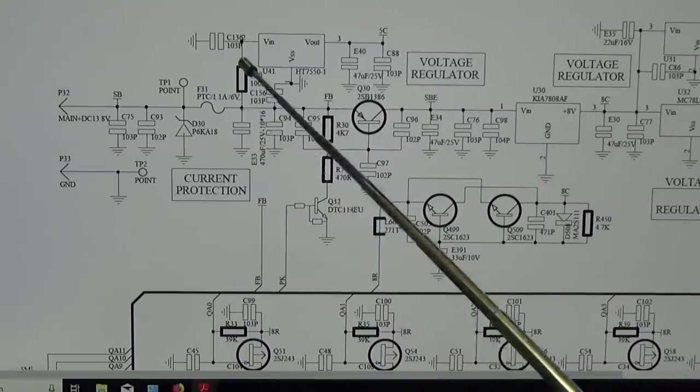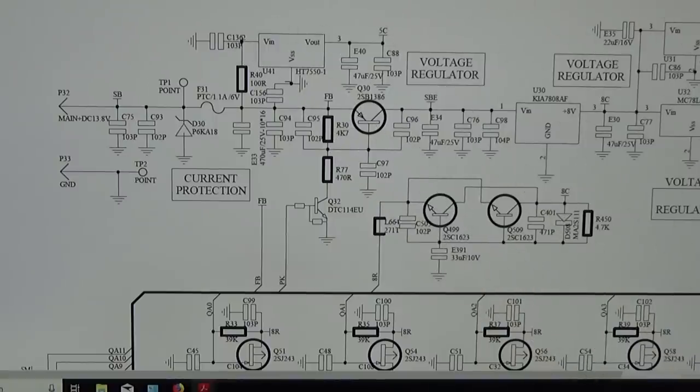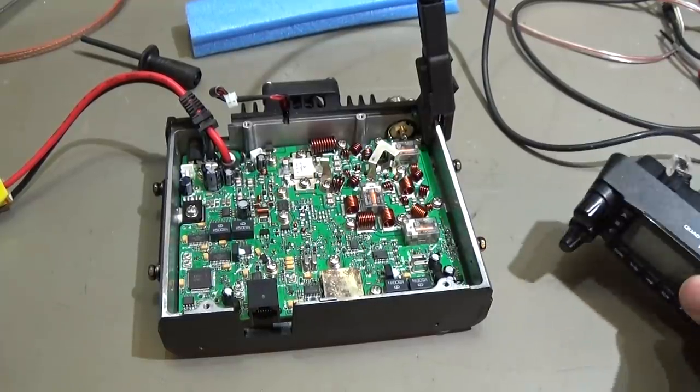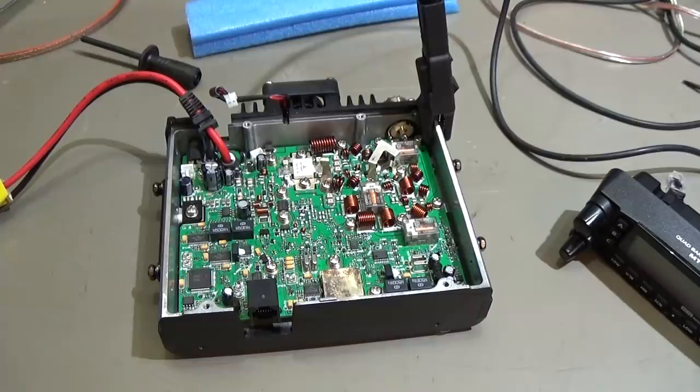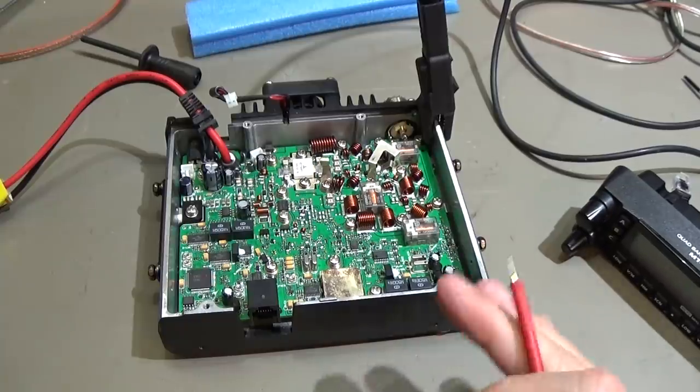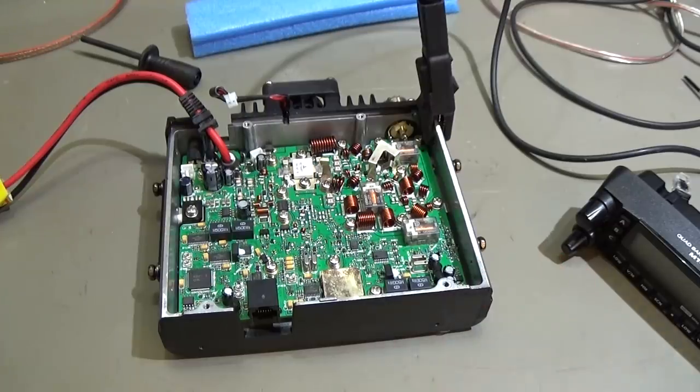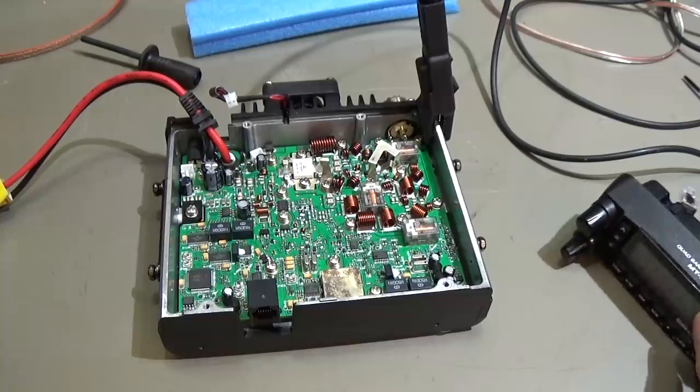And of course, then we should look at our 5C. And again, I'm still wondering where our 100 milliamps are coming from. Is that maybe a short? All right, so let's go step by step. I do not really need to connect our user panel here, since the voltage should be present anytime, right? So that is not dependent on our user panel.